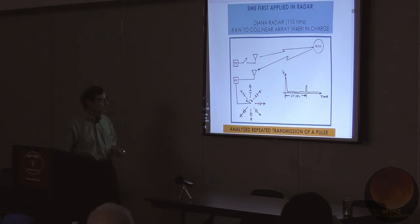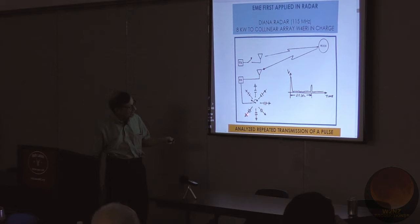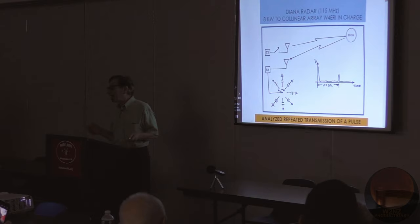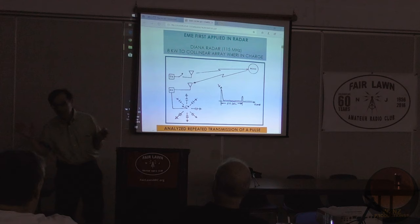When it was doing this, you can picture the system. The signal would go around, be picked up and rectified, and would charge a capacitor. So you can picture a switch with a bank of capacitors turning around. What they did is they sent out the signal and looked at which capacitor had the most voltage. And they did this literally thousands of times. And of course, the more they did it, the more they could show that 2.5 seconds later, which is roughly the time it takes to get a reflection back from the Earth to the moon, they would pick up a large voltage on the capacitor.